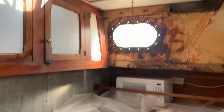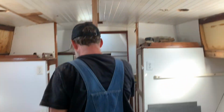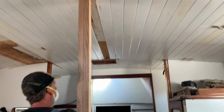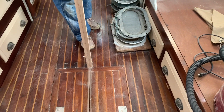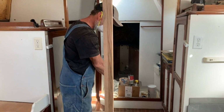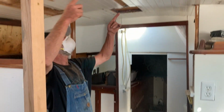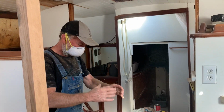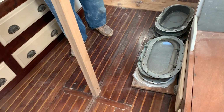And like Ava was saying, the reason this bounces in here is because he took this wall out. And look, it's crushing the floor in right here now. I haven't showed him that, but it's kind of crushing the floor where he's got this jammed in there. So I think what he needs to do, if he doesn't want a totally divided wall, is put something that comes in here, and maybe comes up like this and then goes back out like that, and have a support. He needs a support here, and it needs to go further than just point loading it right there on that spot.